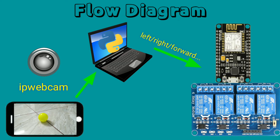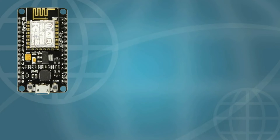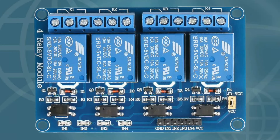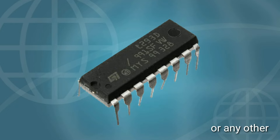Then our NodeMCU and some hardware will drive our car automatically, and our robot will follow the ball. First, look at the hardware of the robot. Here I am using an ESP8266 board and a four-channel relay module for four motors, and two lithium-ion batteries for powering the motors. I am not using any motor driver — instead I am using relays, which work much better in small robots with no problems regarding voltage spikes. Many of you use the L293D motor driver IC — that works fine also.